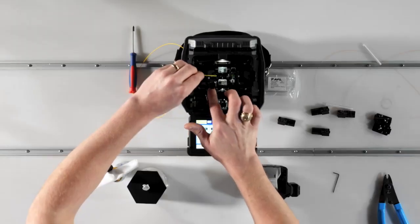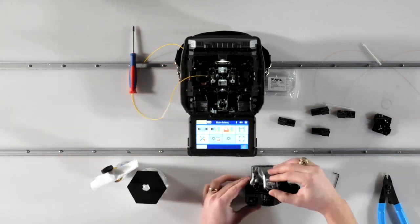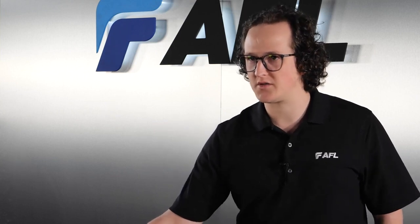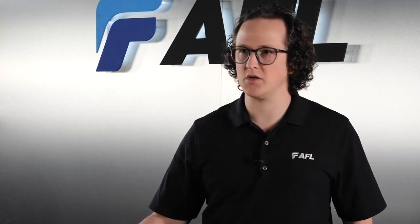When everything is working properly, the cleaving process leaves a clean, flat, and smooth end face on the freshly cleaved fiber. However, everything doesn't always work the way it's supposed to. Many times, a dirty, oily, or dusty fiber is cleaved, transferring whatever contaminants were on the fiber onto the cleaving pads and onto the cleaver blade.